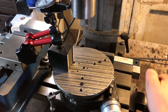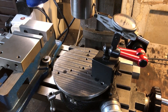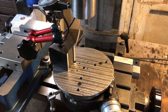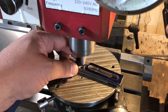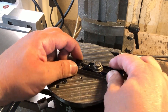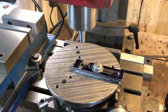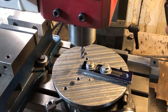There is a sacrificial plate attached to my rotary table with no concentric reference on it, so to align this I am sweeping the spindle using an indicator and then zeroing the DRO. The part is then aligned on the rotary table using a 5/16th pin in the collet. I have a selection of these pins concentrically turned with one end to match my mill collets and the other at various common hole sizes. I have to say that of the quick and dirty set of aids I've made over the years these have to be some of the most used.